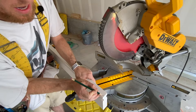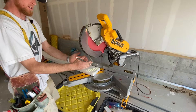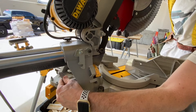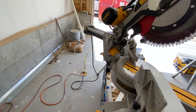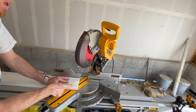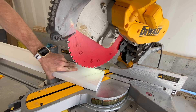The other thing we need to do is cut this at an angle. On that brick molding there's a slight angle, so we know it's a 9-degree. We've already got our saw locked in at the angle of the rake, so now we need to come over here for a compound miter and move this side over to 9 degrees. Tighten the saw down — not too tight, but snug. We've got it set at a 9-degree miter and it's still locked in at 35 and a quarter. We're set to make our first cut from the very tip of our piece of material.